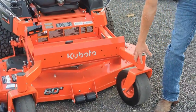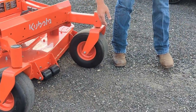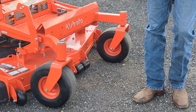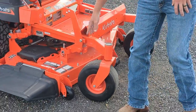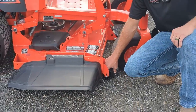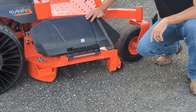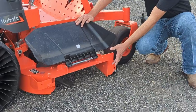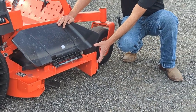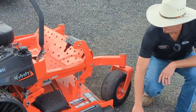You can get under there with an airline or a hose and get everything nicely cleared out. Up here on your front caster wheels, the top spindles are greasable as well as the bearings for the wheels. You have front rollers as well as casters on both sides to aid in anti-scalping. There's a very wide ejection chute coming out of a very tall deck so you can handle a lot of volume of grass, especially wet grass, without clumping up and causing issues.